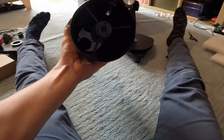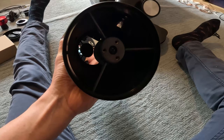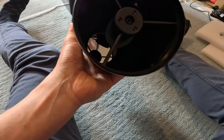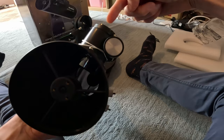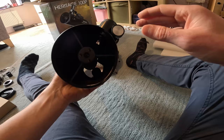With the dust cap off, looking down the business end: there are three spider vanes holding a secondary mirror, which is adjustable via an Allen key, and the primary mirror is down at the bottom. Light enters the tube, bounces off the primary mirror, bounces off the secondary mirror, and goes up to the focuser where you put an eyepiece - or in this case, a camera, which is a bit unusual. The Heritage 100p does reach focus with a camera, which is one of the neat tricks I mentioned.